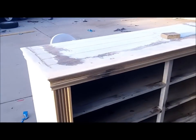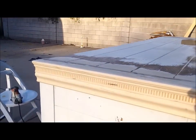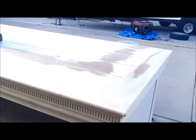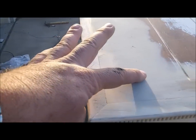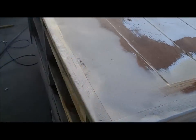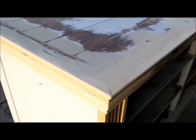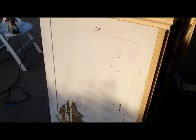Okay, I'm pretty much done — this is pre-paint. You can see I got the detailed edge and what I guess isn't crown molding but fluted casing and nice millwork. You can see the edge — I had to put that strip in to build it up after I cut off the rounded corner. Took really good wood putty and built that up. Right now we're pre-paint and I'm probably going to start putting a couple coats on.